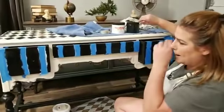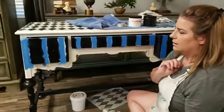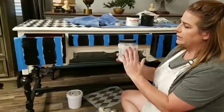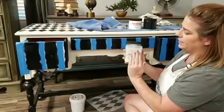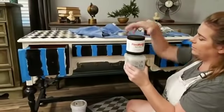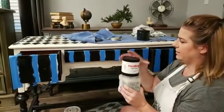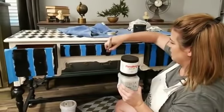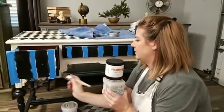So really quick, Brittany had asked about bleed through. Let's go back to address how to minimize it. You can take either your Dixie Belle clear coat that you're going to coat your body in, or your body color, and rub it along the edges of your paint line. What bleeds through under the tape is then your clear coat or body color. Now it's nice and sealed off, so when I put my black over the top, the black isn't bleeding through. The first thing you put over that tape is what's going to bleed through.